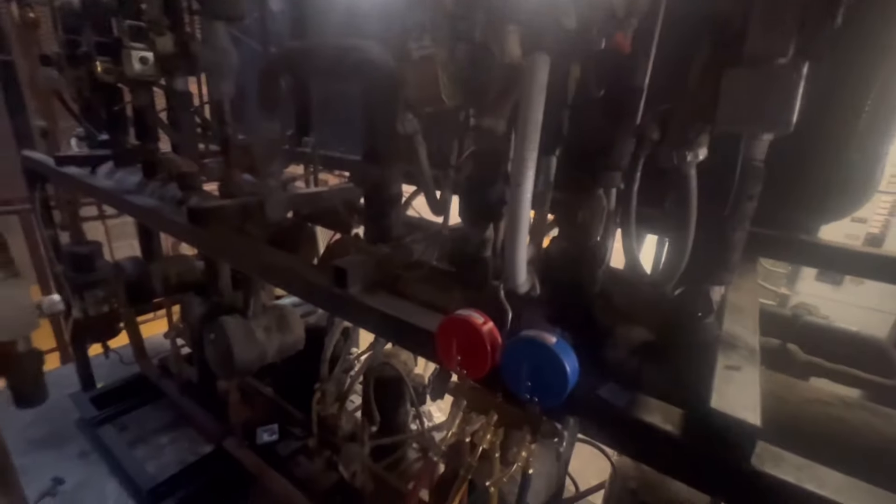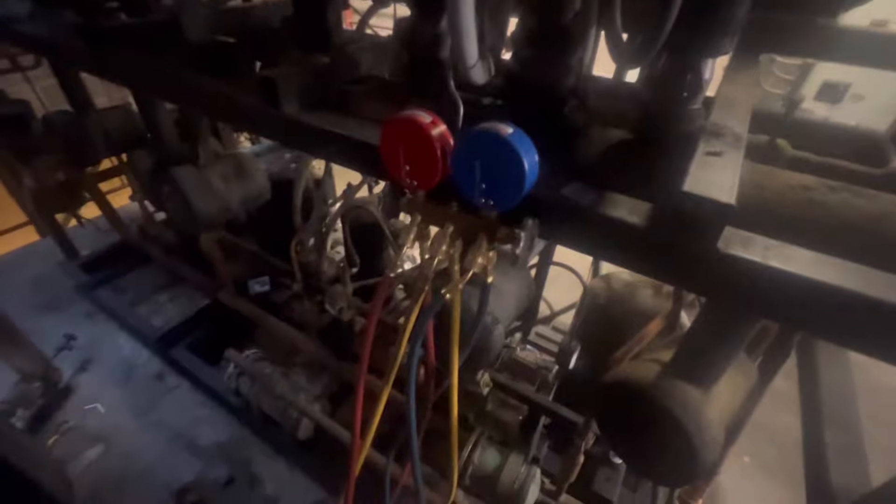Let me get back with y'all. I'm gonna hook up my gauges, see what my pressures are, and make sure everything's running like it's supposed to — make sure I got gas in this rack. She feels good: line tip and all, sight glass right here so I can see if it's flashing or not.